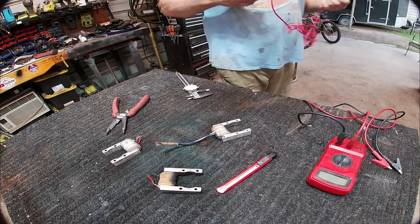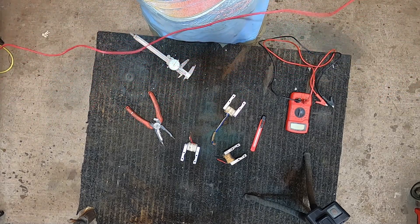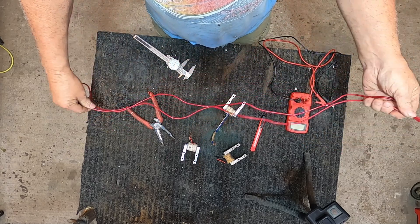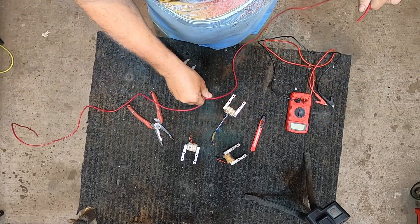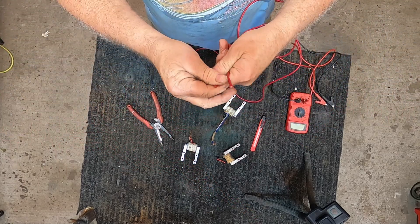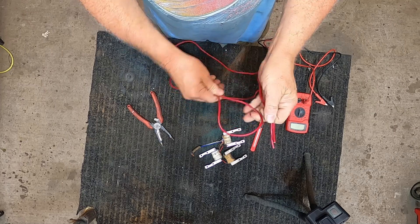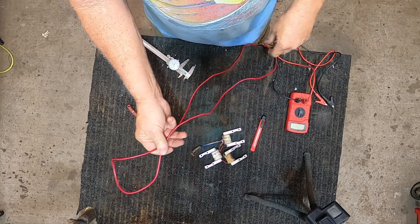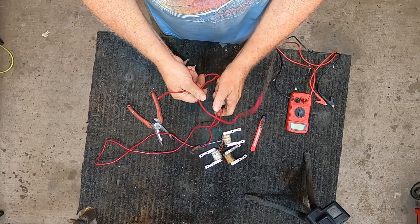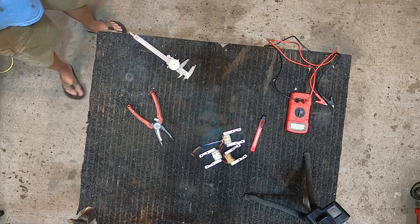We'll do a single aid here — don't laugh. Let's say this is the total length of what's in here. Let's just say it's four foot. None of this is supposed to touch because it's shellac coated, just like in here — or lacquer coated, whatever magnet wire is. Let's say it shorts out at this distance. We still got a foot and a half here, a foot and a half here — we got three foot. Let's say it shorts out right here — now our path is a lot less. And I think that's what's happening.